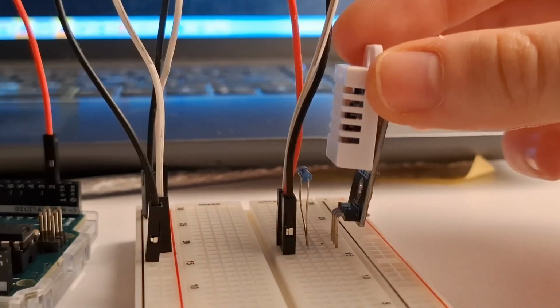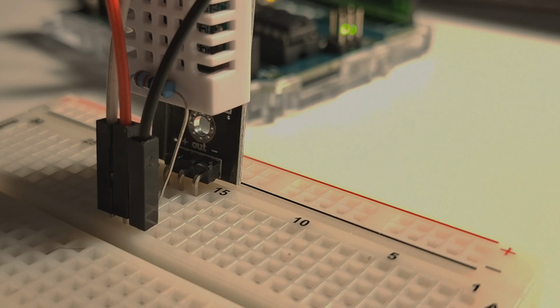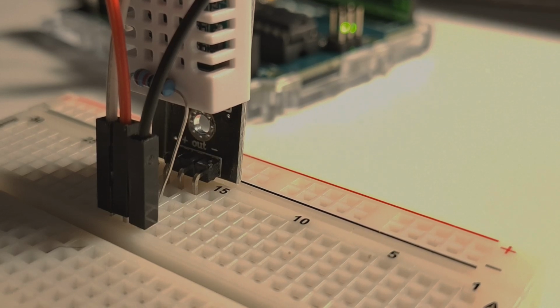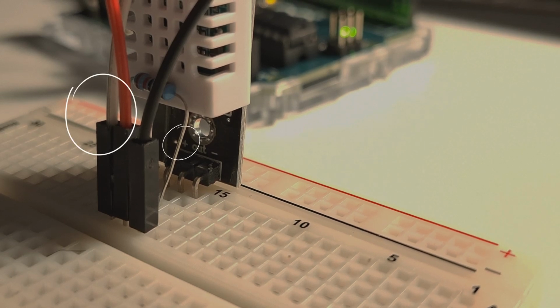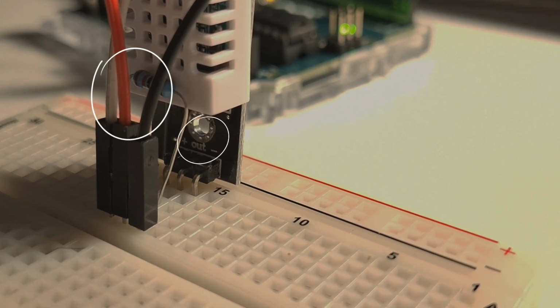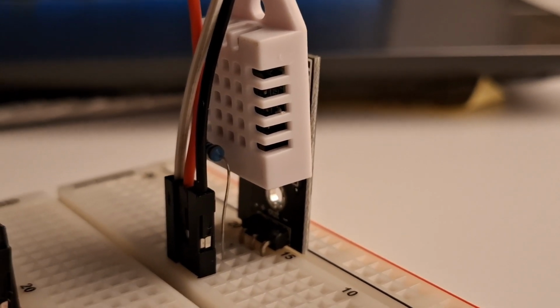Time to move this aside. Let's install the DHT sensor. My sensor has 3 pins: positive, out, and negative. There is also a variation where the pins are VCC, out, and GND. We need to connect the white wire to the positive or VCC, black to negative or GND, and our output to the red wire. Here's a better view of the assembled circuit.